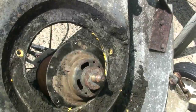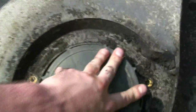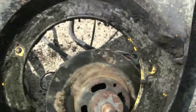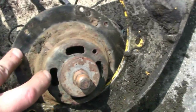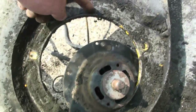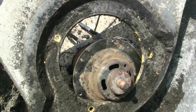Now the trick is going to be figuring out how to mount it. It's still going to have to be mounted maybe about an inch up in the original motor hole, so the fan is not going to be completely below the deck. I'm thinking I should be able to get a flat piece of plate metal, cut a hole in it to fit the motor, drill some mounting screws, space it up with spacers, and probably also drill a fourth hole maybe about here to strengthen the mounting a little bit. I'll fiddle around with that and see what I can come up with from what I've got laying around, or maybe find something that will work straight out.